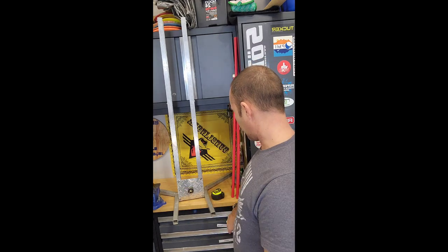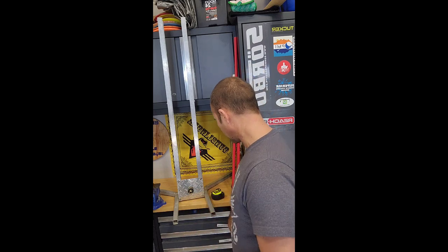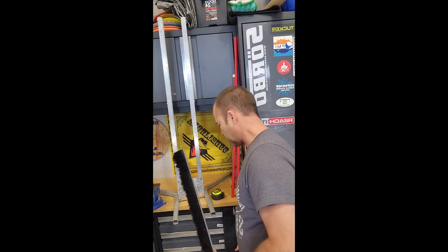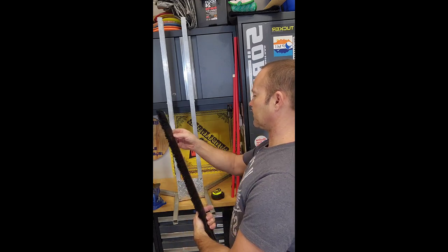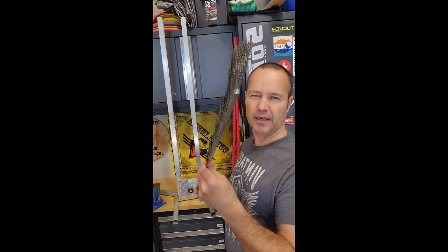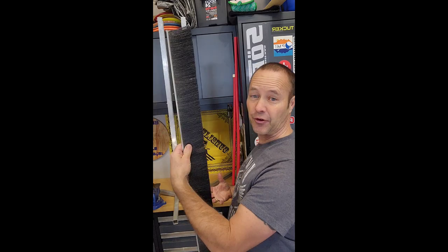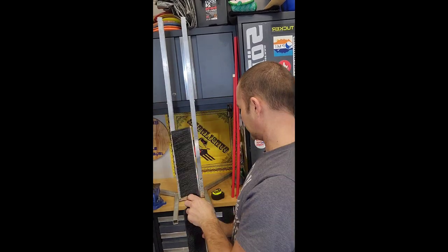This was a quick, easy build. Since the time I originally built it three years ago, the parts have gone up quite a bit, especially the brushes. What I did is put eight brushes on it — eight brushes for the agitation. Most brands out there only give you four brushes, so eight brushes gives double the scrubbing power. The brushes I use are a three-inch nylon brush. I bought them in 72-inch lengths and cut them in half, so I have eight 36-inch brushes with a stainless steel crimp that holds everything together.